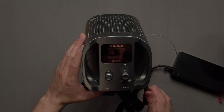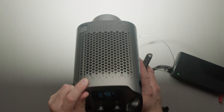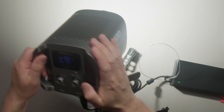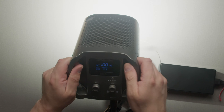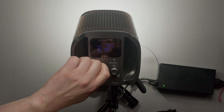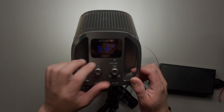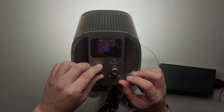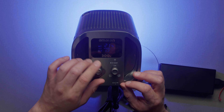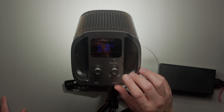So let's take a look at the controls. You do get the toggle switch on the bottom here. One thing to note — when you tilt the screen forwards and backwards, you lose the screen. So the screen is not the best; you are losing some of it. Left to right seems to be much better. So you will need to use the Sidus Link app with this. This thing goes from 100% power all the way down to zero. You do get fast dialing or you can dial it in slowly. Just be careful that when you do this, you don't push this in and change things. When pressing the knob in, you get control over your CCT and your green-magenta shift.